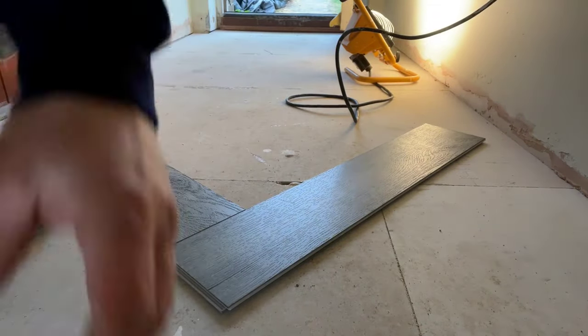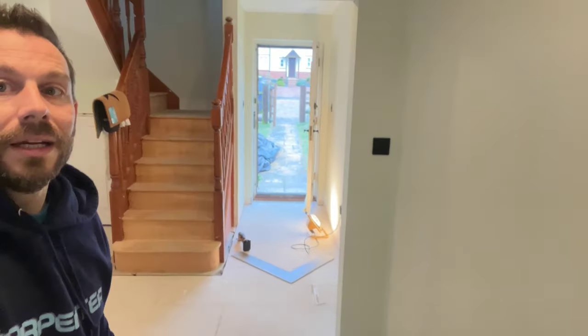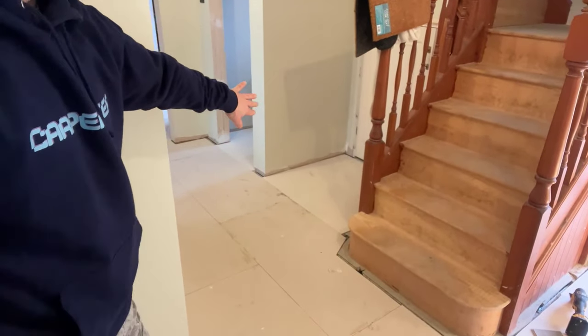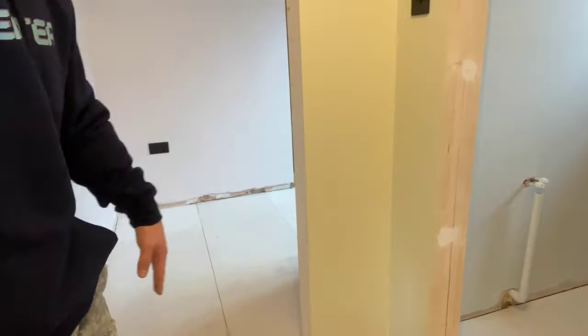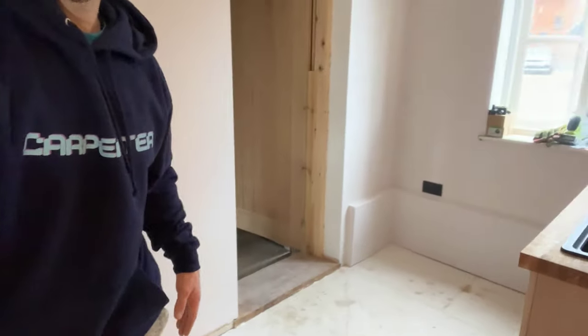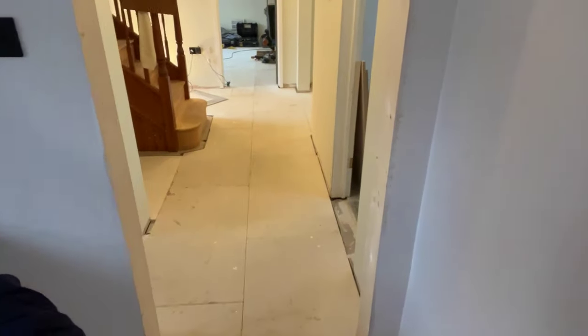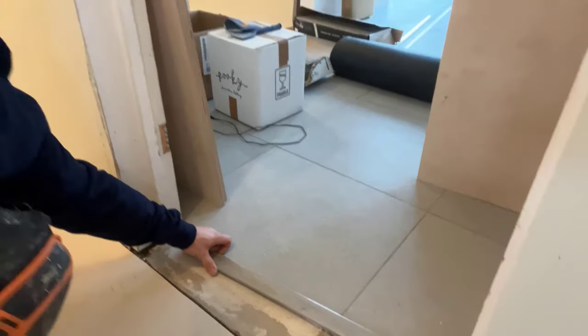Then what I'm gonna do is measure up the width of that hallway, shoot a chalk line in the middle, exactly on the peak of that V shape or A shape, and we're gonna spread the job, let me show you, around that staircase, into that little under-the-staircase storage. It's gonna stop in front of the toilet, and it's gonna go all the way to the utility room. That's the utility room. From this way, it's gonna look like a zigzag. And we're gonna put the threshold later, overlapping the tile in the kitchen. That's the kitchen.